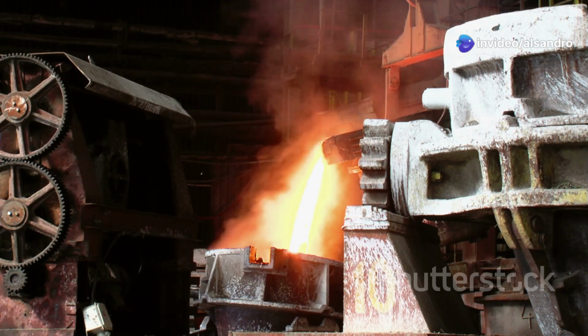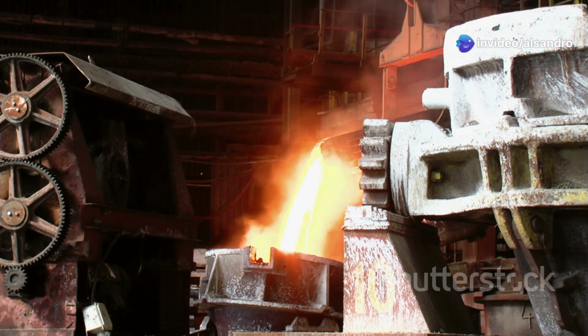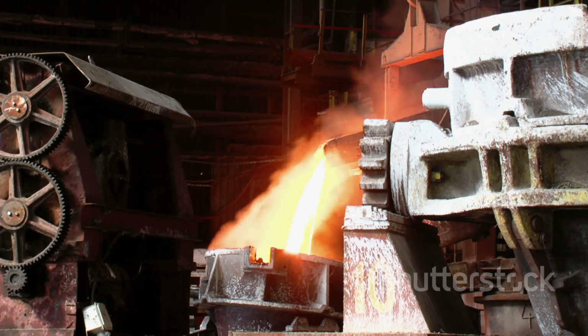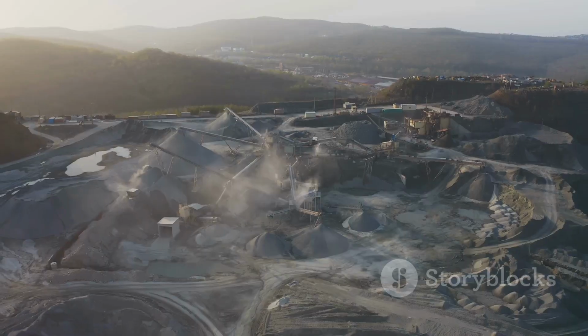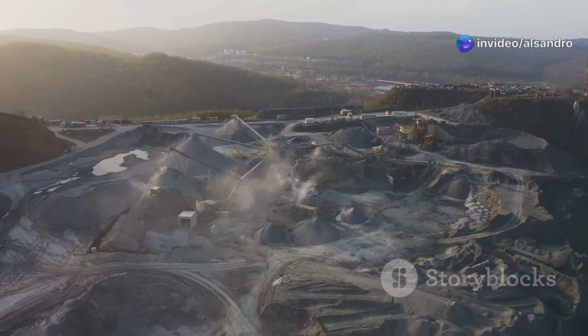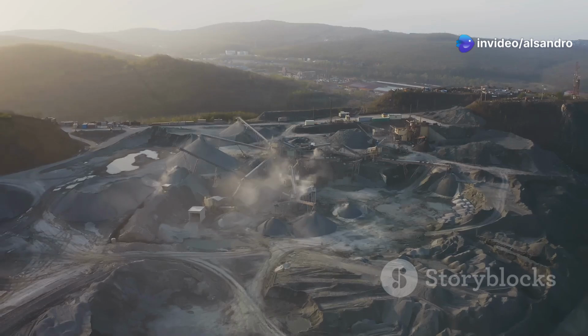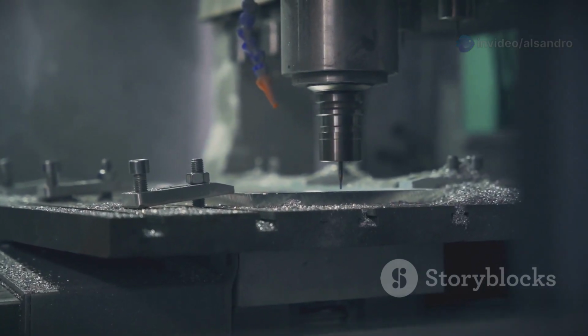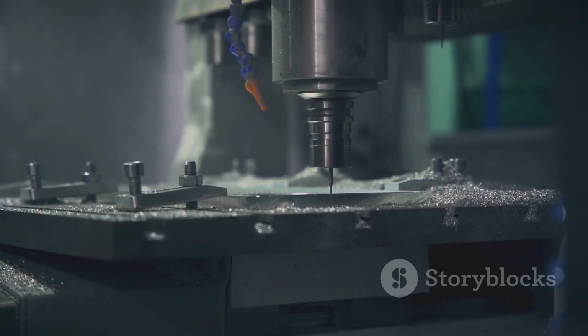And while, yes, melting metal is an energy-intensive process, no matter how you slice it, the sand system itself contributes to a better overall footprint. Because the sand is reused so extensively, we're reducing the need for constant quarrying and transportation of new raw materials. There's less energy expended in manufacturing synthetic binders as well.